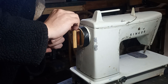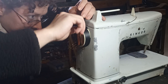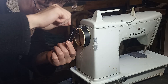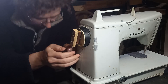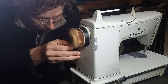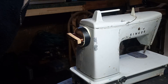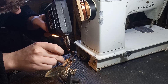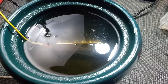So here you go — I got a couple of winds over the wood block. I took the pickup bobbin off, got those winds back away from the wood and onto the bobbin, did some hand winding, got it all straightened up, screwed it all back down, and onward again. Even if you get a wad of loose winds and you crumple them up on the side of the coil and cover them with other winds, it'll be fine — all it will do is give a little sparkle to that pickup. Luckily this one turned out good. I just need to break the wire, wrap it around a lead, solder and shrink wrap it, throw some pickup tape on the coil, connect a lead, and then send it in the wax bath.